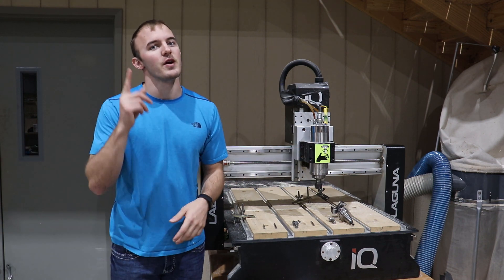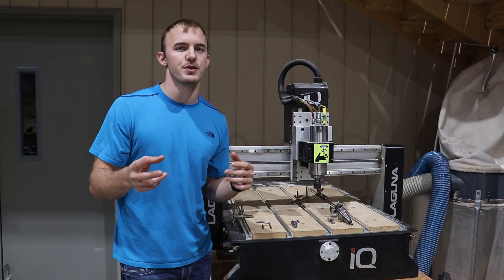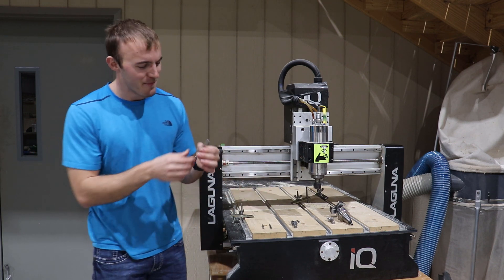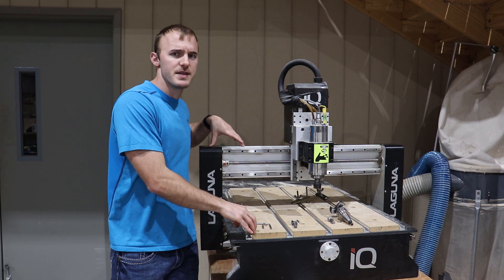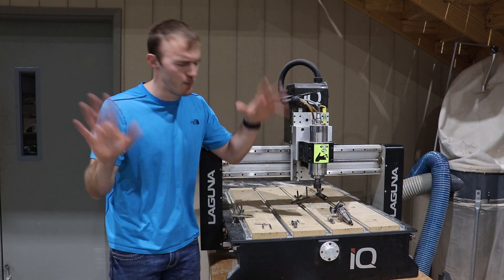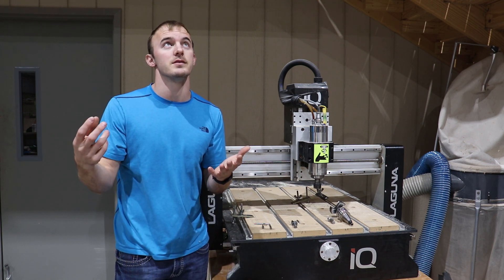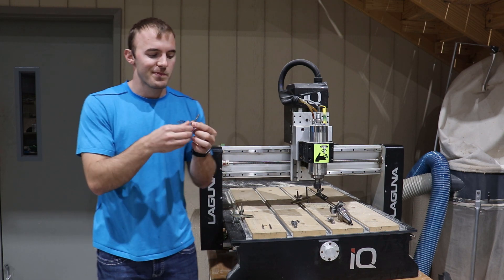Let's go to the very first bit, which is a quarter inch end mill up cut. Why do you need a quarter inch up cut when you're first starting out? Assuming you have a hobbyist type CNC — maybe a Shapeoko or something similar — you don't want to go any bigger than a quarter inch bit when first starting out, because most likely your CNC is not going to be able to handle anything over a quarter inch, which is six millimeters.